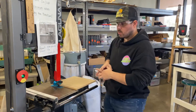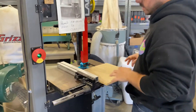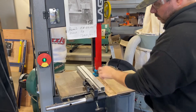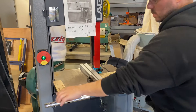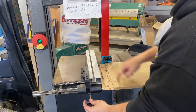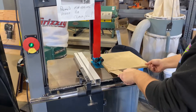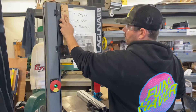That's important because this machine will grab you. You can use this to do straight cuts if you want, especially if you're repeating. You can also use this push stick to do smaller cuts that your hands wouldn't be able to get to. Bring it up like this and you can do smaller cuts to trim pieces. This is also good for when you're finishing a cut — use this instead of your hands so it's not your finger.